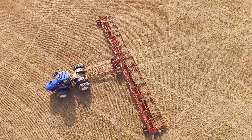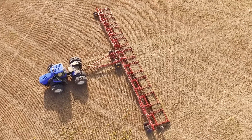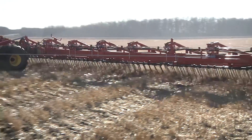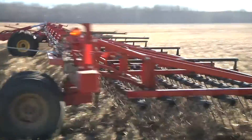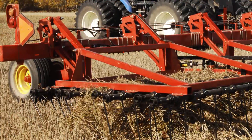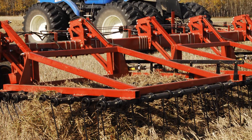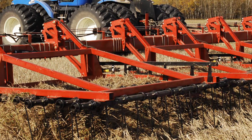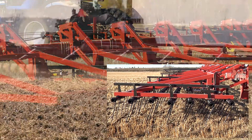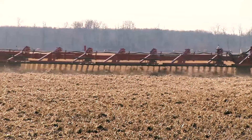The XR770 frame is based on the proven cart, boom, and autofold designs of the 7200 Heavy Harrow. Available in 70-foot or 90-foot models, the sturdy construction will provide many acres of reliable service. An 8x8 fixed-height boom supports 10-foot wide harrow sections. Each section is composed of 7 rows of half-inch by 22-inch tines, creating an effective spacing of 1.4 inches that will produce a smooth field finish.